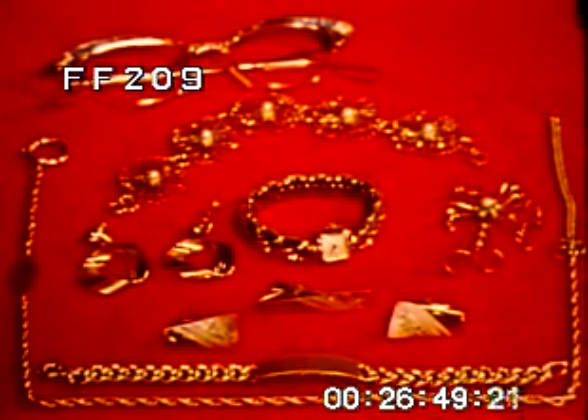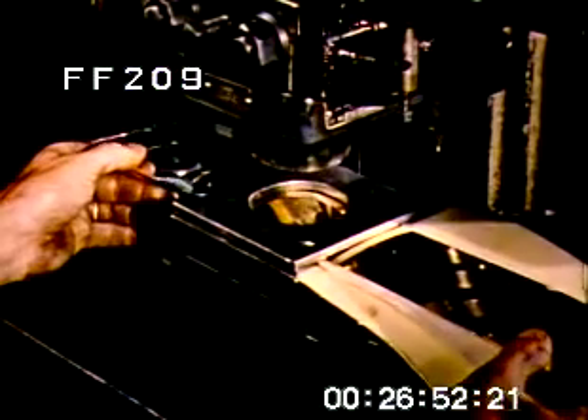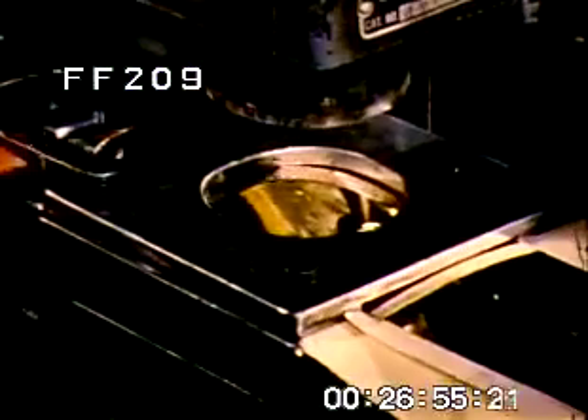Now even though a combination of fine gold and alloy has come a long way from the gold room, the end products fashioned from it must still reflect a high degree of skill and imagination. Nearly everything made of gold-filled material, as in this first step in lighter cases, needs special tools to coax the metal into desired shape. For these cases, flat oval blanks are drawn many times and annealed each time, before they become top and bottom sections of the lighter. Here are the various stages — the result, a fine gold-filled lighter.